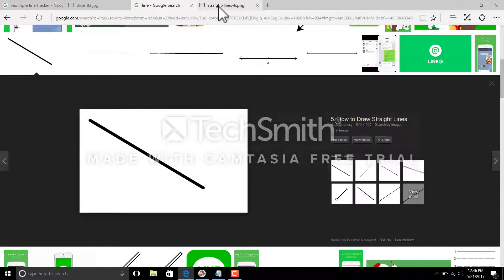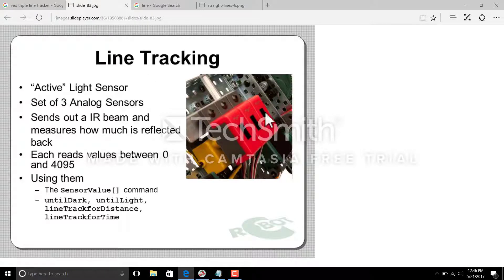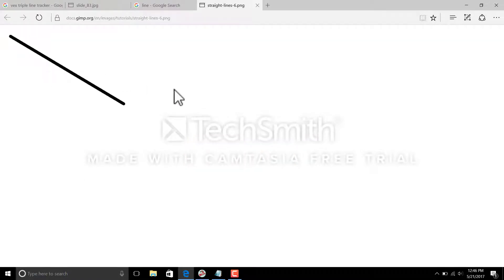To illustrate with a sample line: this is a dark color — a black line — and there are two sides of lighter colors on either side. Each of the three sensors reads a different threshold. The light reflected back from the line the robot is traveling on causes the robot to be aware of whether the line is deviating or turning. The robot constantly re-measures how much light it receives, and if it's getting a darker pattern it knows it's traveling off the line and needs to get back to it.